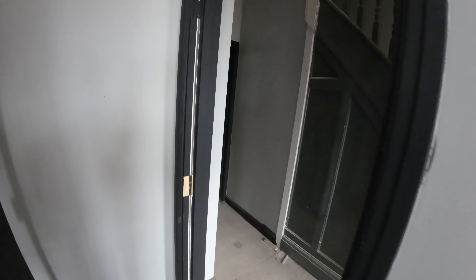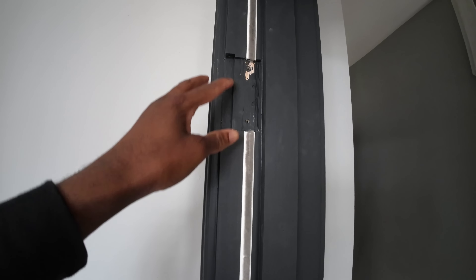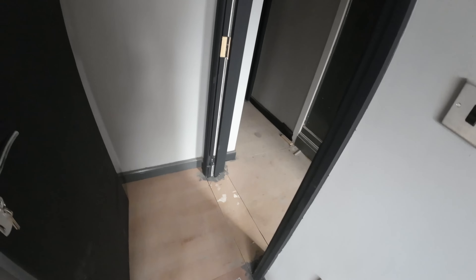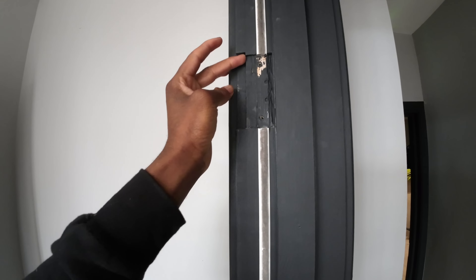This is a new frame — the last builder put in a frame but didn't put it in right. They've added a piece of timber onto the frame, but really they should have moved the frame over and added the piece on the other side. They've tried to chop out some of the timber because it was snagging on the hinges, and the door didn't close properly, so I've had to take it off and adjust it — he's literally just chopped out some of the frame. With fire doors, they're meant to have a three to four mil gap; this one has around a six mil gap, and that's why it has failed the fire check.